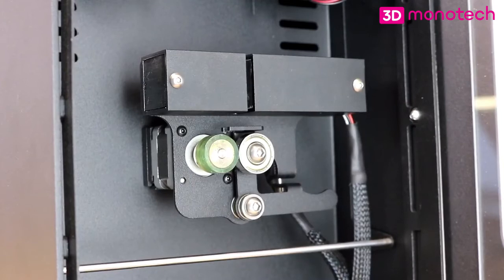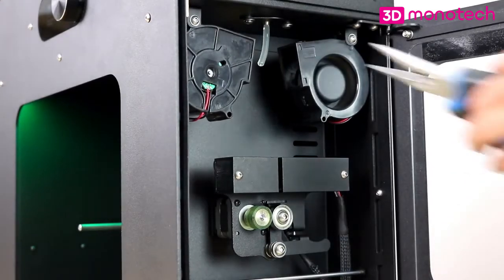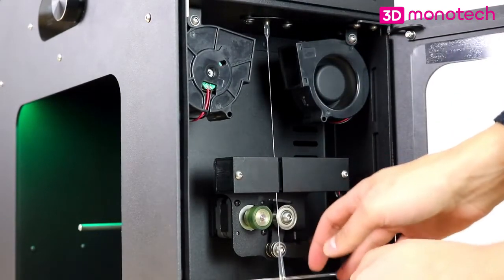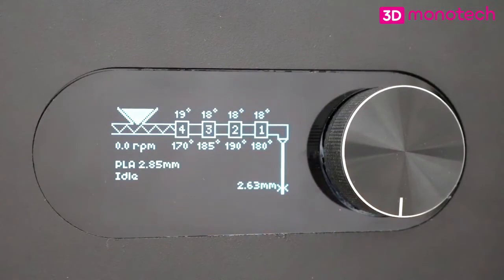This is the optical control system, also known as the filament sensor. Based on the measured filament thickness, the puller mechanism is automatically adjusted to pull the filament to the desired thickness. For accurate measurement, it is important that the sensor is kept clean and the filament is positioned perfectly vertical. The measured thickness is displayed on the home screen.